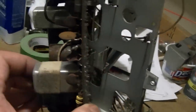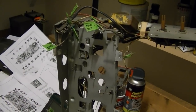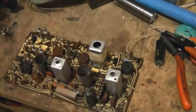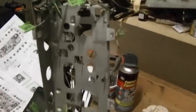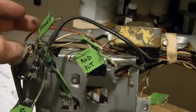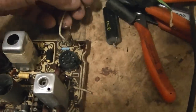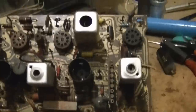After replacing just a single resistor on the board, I broke down and decided it would be far easier in the long run to just unwrap all the wires, unmount the board, and work it on the workbench. So I made all my little sticky tags so I can reconnect everything correctly. I've got the board out now. This wire I just cut off because it was kind of short and crummy, so I'm just going to replace the whole wire. This one was soldered on to the post, so I decided it was easier to undo the other end since it goes to a filter cap I still have to rebuild.